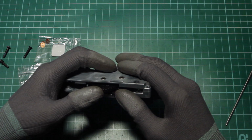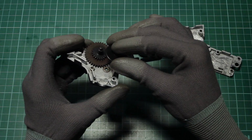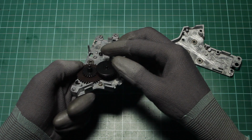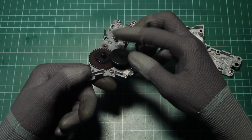We want a minimum of at least 50% contact area between the face of the gear teeth. More than that, and we get better transmission, but with a higher risk of rubbing the gear faces against each other. Lessening contact area gets us more clearance, but risks chipping the gear teeth due to lack of support on the load.